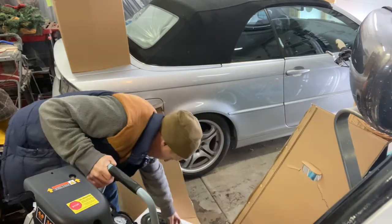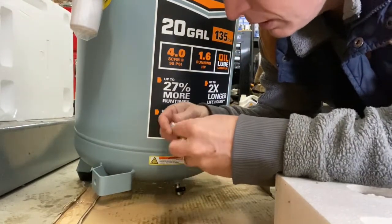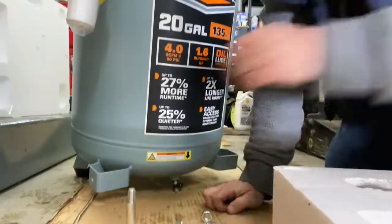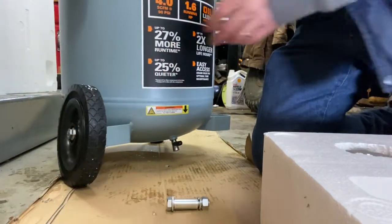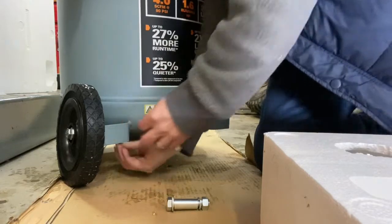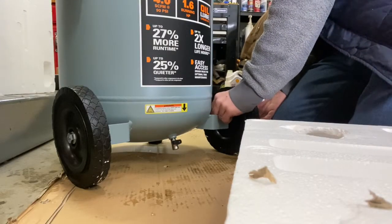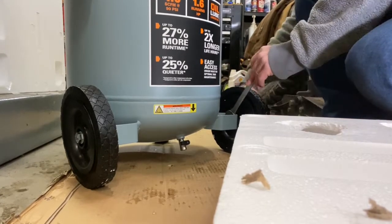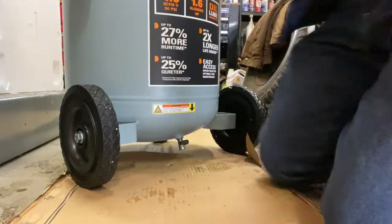Feels like there's something on the bottom — there's our wheels. Welcome back to the ground floor. Here's where these nuts and bolts get utilized that we found in the top. Basically these are axles; the wheel's going to ride on that so it will actually roll. That makes a horrible squeaky sound. I'll tip this up — that goes on there. Lock nut and nut. I'll snug this up after I get the other one on. 17 mil will fit on the outside. This is an adjustable crescent wrench, seems to be the perfect size. Wheels are on.